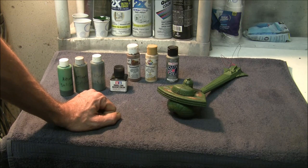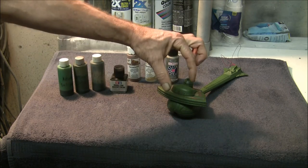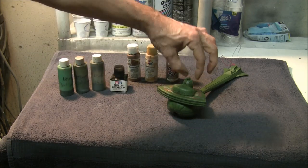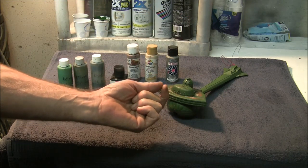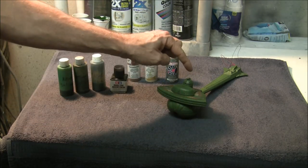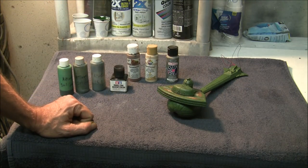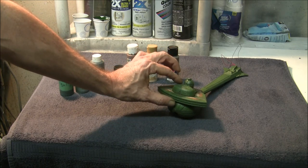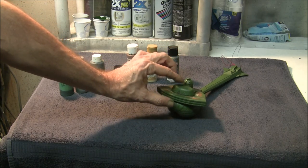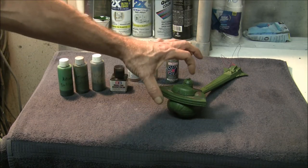When I went to test fit the resin part, there's this tiny little clear lens that you have. It's sort of a pie wedge shape, just a narrow slit like a circle with a socket on the bottom of it for a 5mm LED to fit in. And that's the lens for the red lighted area that you see where the little bridge windows are. And these two pieces sandwiched together. Well, the clear plastic piece fit good into the lower section really close, and then when I tried to put the resin part on the top, I saw a big gap.